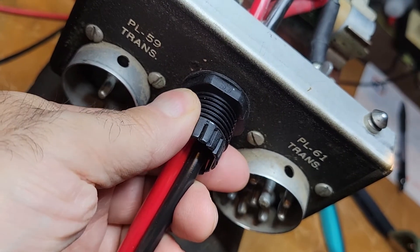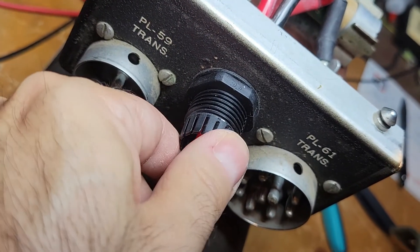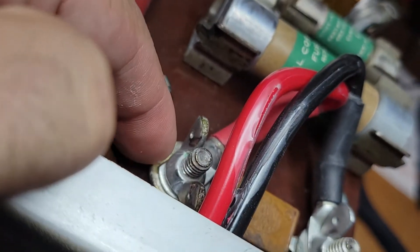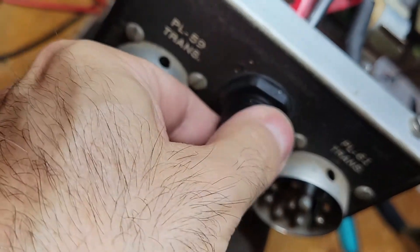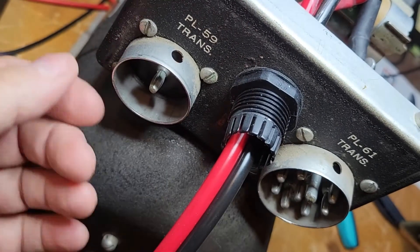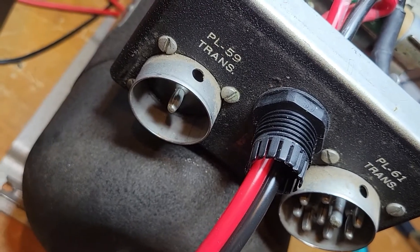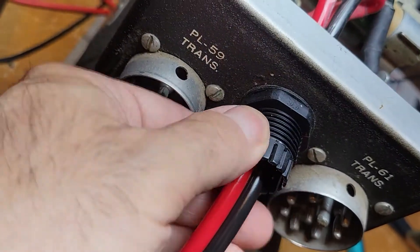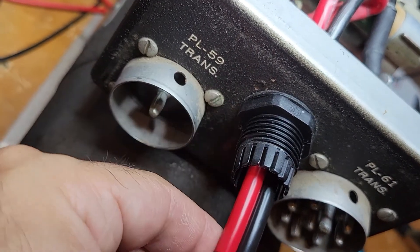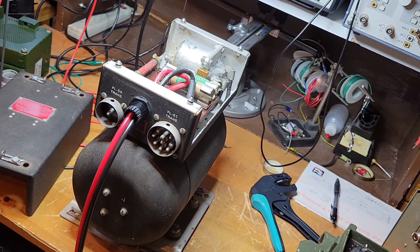I wired that in with lug connectors - very easy, about 15 bucks. I also added this piece from a cable gland - the outer assembly part without the weatherproofing compressor. I used just the outer shell because I didn't want these high-current wires' braiding rubbing against the inside of the metal and over time possibly losing insulation and causing a catastrophe. So I stuck this through - there's a nut on the other end - and it just provides a softer raceway for these wires.